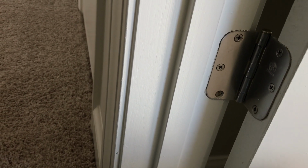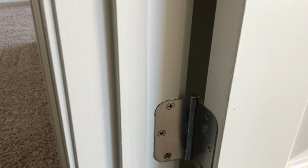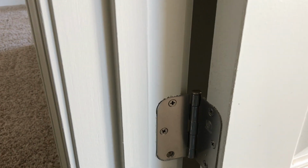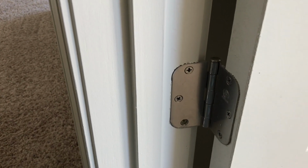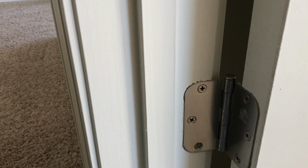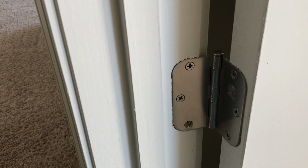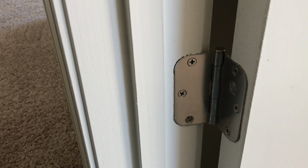I do literally hundreds of these where I'm working now. And the simple trick is, you'll hear some people say, put a golf tee in there, buy golf tees and break them off. Golf tees are harder wood. Yeah, that's true. Or cut up window shims and put that wood in there, pine or whatever.